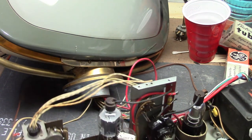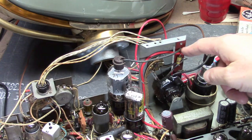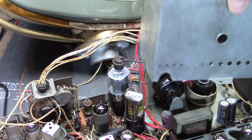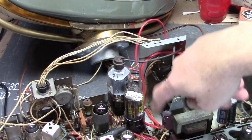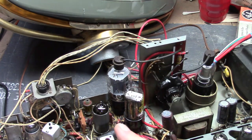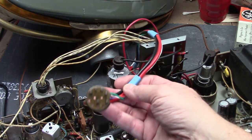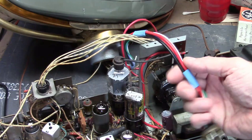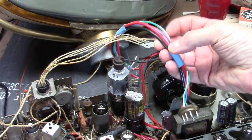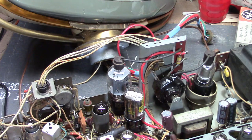There is one wire running from the flyback down, making a loop outside the shield - normally there'd be a box over this - out through an opening at the bottom, going to the main board right behind the damper tube. That's one place you should use it. The other is two of the wires going into the yoke plug: the black and the red. This wire is readily available, very flexible, and has the right insulating properties.